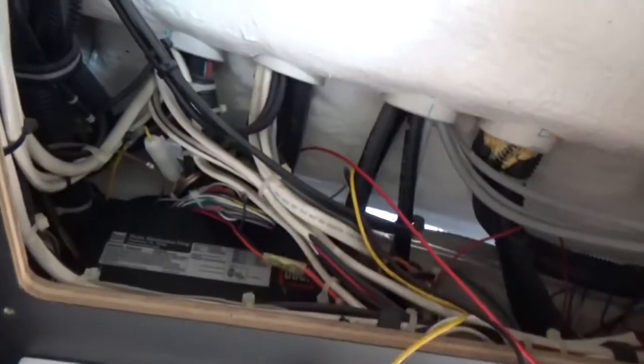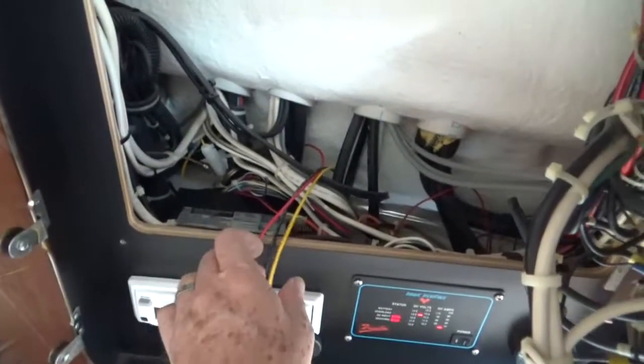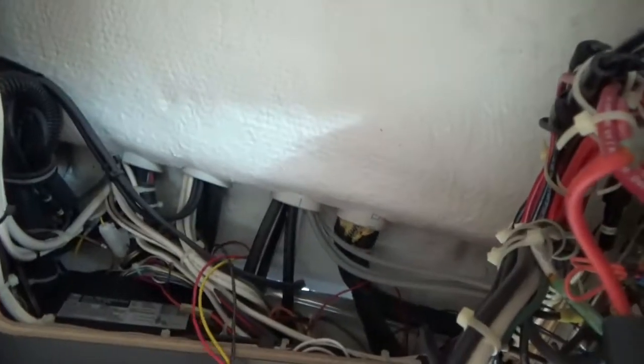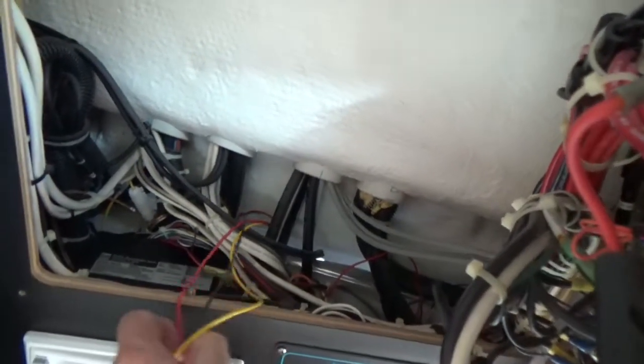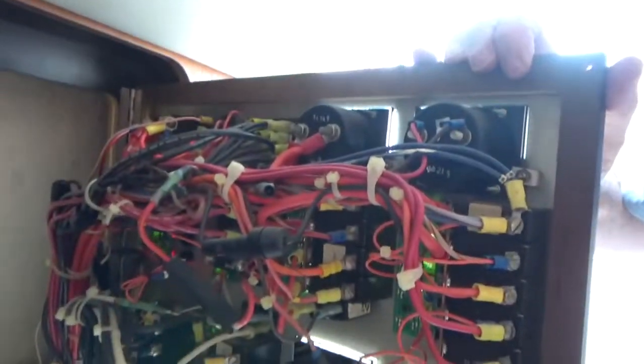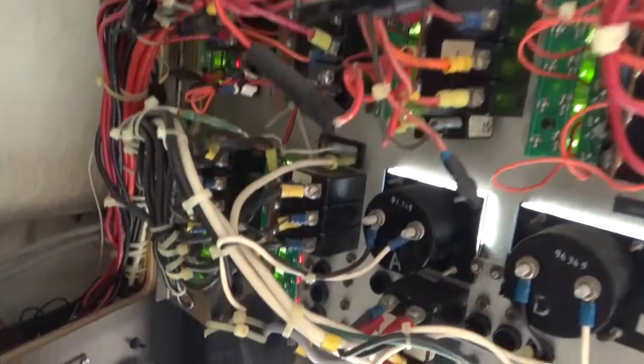Here's my pull wire — you can see it's pulled up the cables. Should be just as simple as bringing these up a little bit further. I'll bring in all the slack and loosely figure out the terminations on these, then tie them all down with tie wraps. Power is going to come off of this board right here, and so is the ground — there are some grounds down here. That should all work out pretty good.